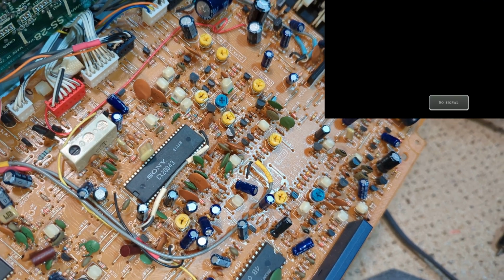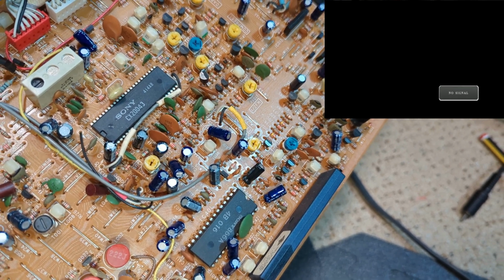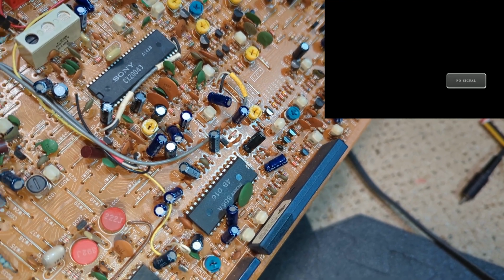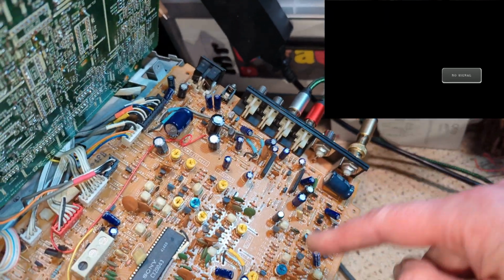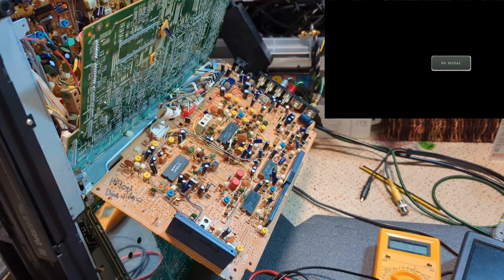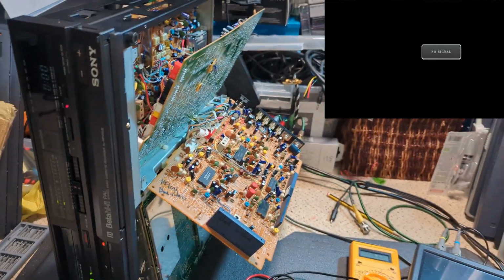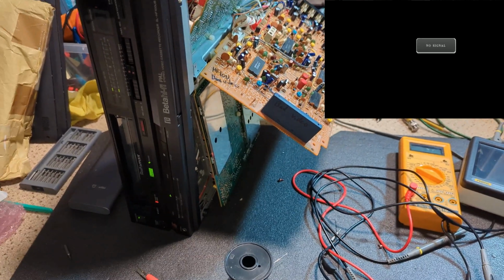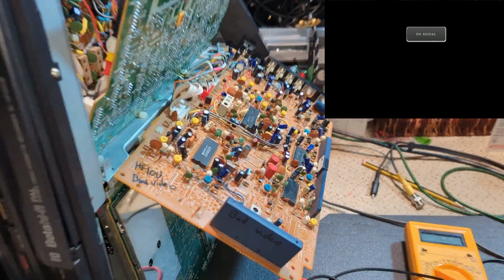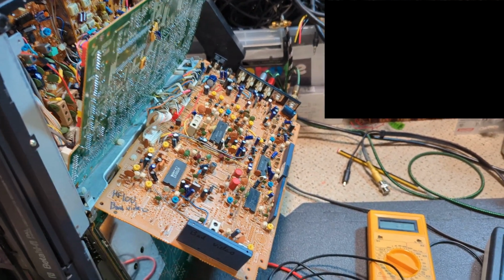Might that be easier to diagnose? Maybe. We can certainly follow the video signal. I'll probably follow it back from the outputs, as long as the heads keep rotating long enough for me to test it. But I don't have anything there at all. Is there video on that cassette still? It's not like I've reached the very end of the cassette, because I've run this for quite a while, remember. I might just put a signal through this actually, just to see what that's like.